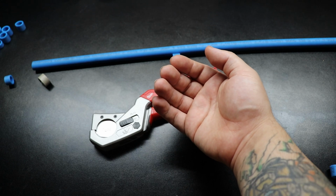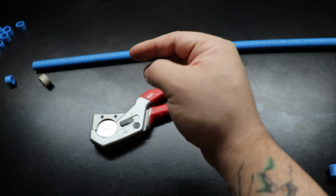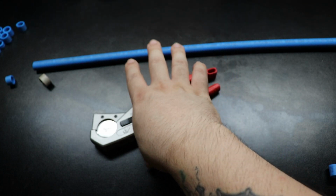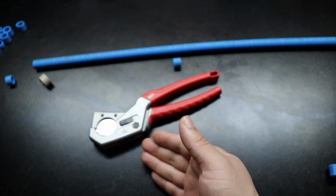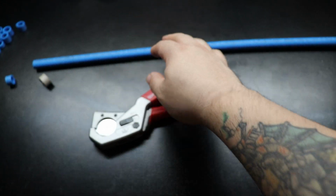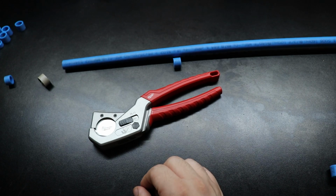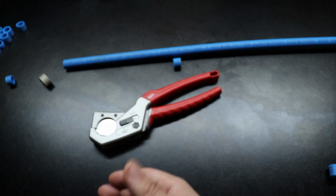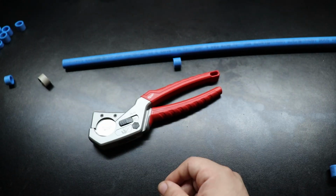So, because I know the landlord is not going to do something about it, I'm going to be removing the wall panel up to mine. I'm going to be cutting out the PEX B, or at least cutting off a section, and adding in a SharkBite. Now, I could put in a crimp PEX B. I'm only putting in a SharkBite because I'm not sure if they're going to go with 3/4 in the future or if they're going to do that. So it is a temporary fix.